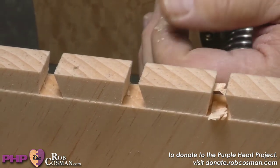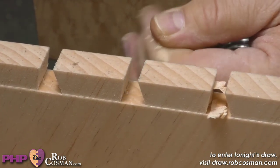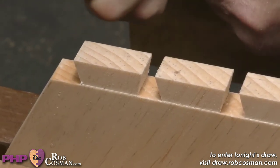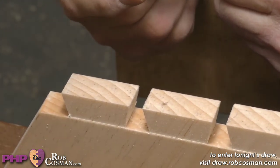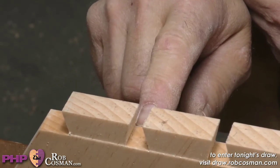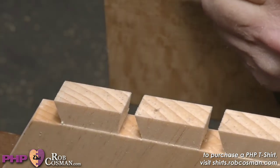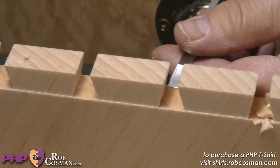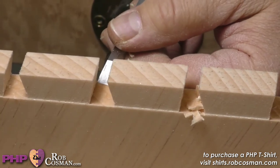Are you wanting to grind more chisels? I don't mind, but... If you look in there, what Jake's talking about, this is the advantage of a 17 degree, because it allows the chisel tip to penetrate the wood without putting excess pressure on the fiber, crushing the ones below it, which is typically what happens. So you're able to go in there and just slice this stuff beautifully. As Danny would say, like butter.